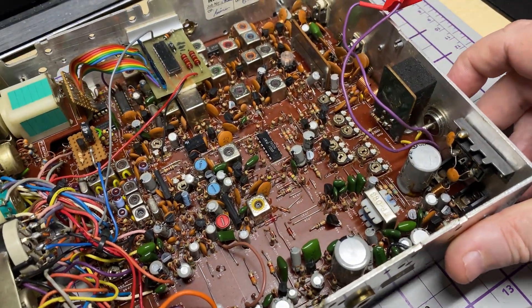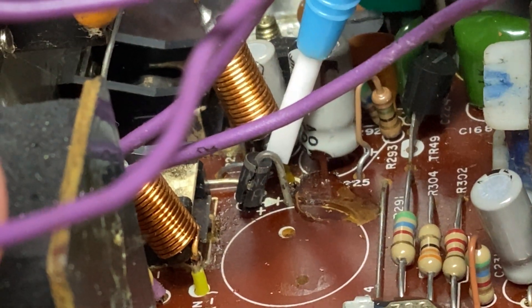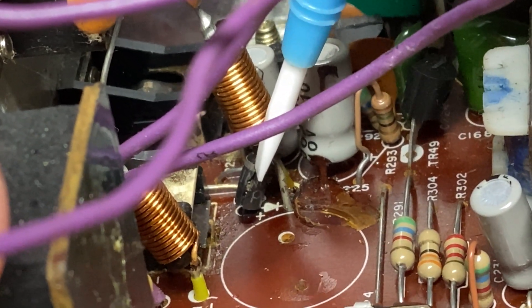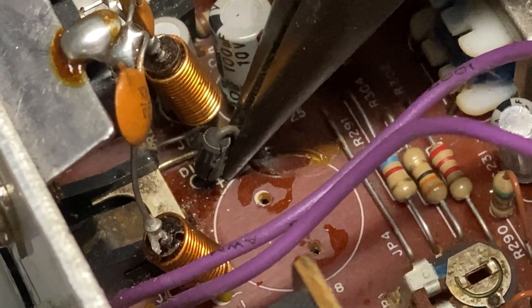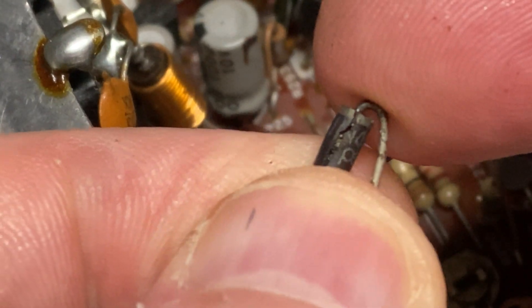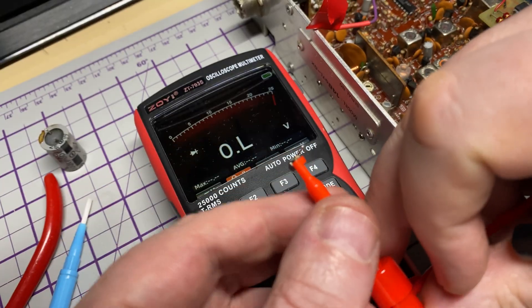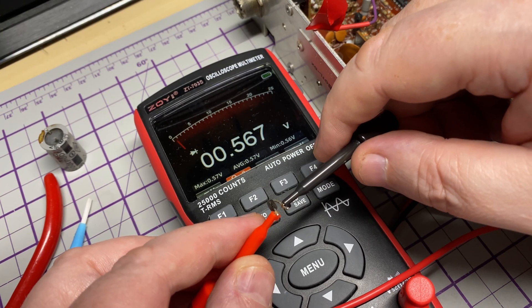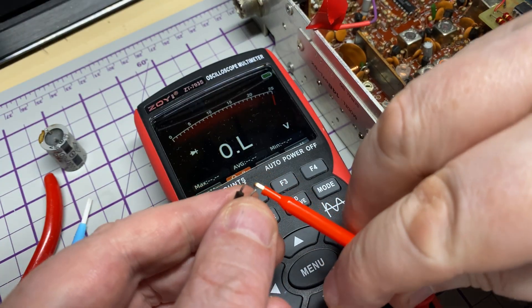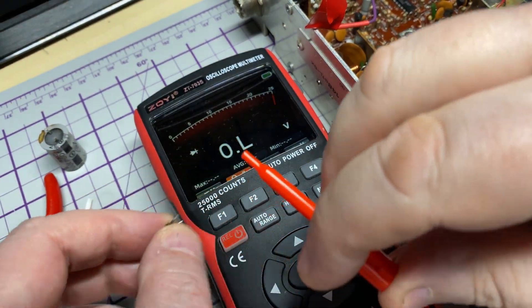What I've got planned for this radio is a full recap - taking the capacitors out. And notice this: that will kind of correlate with the heat mark we had underneath. You can see there's a nice split down the side of the diode. Obviously this has been reverse-polaritied at some time. The question is, is this still a diode or has it left this world? Let's test it on the meter. We're on diode test and it still thinks it's a diode. For how long it would have lasted under another reverse polarity, who knows. But we're going to replace it anyway and put an extra one across the power.